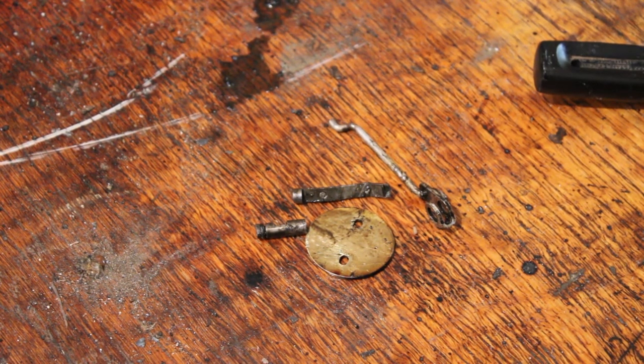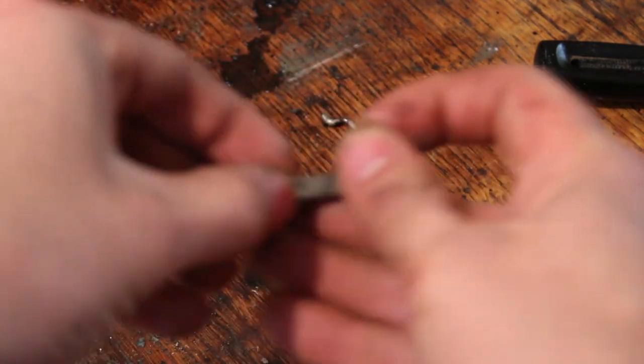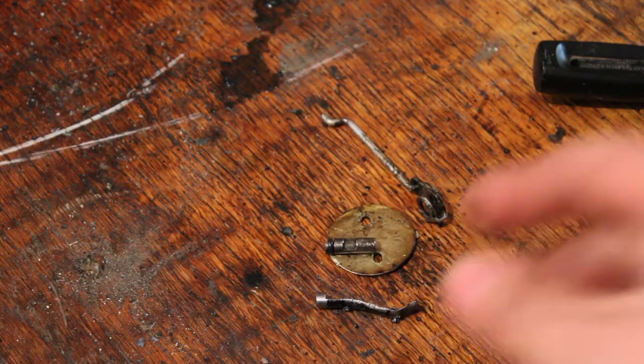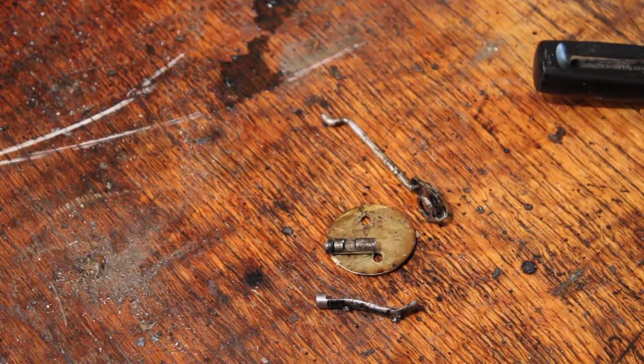I got started with it and it took me the better part of two hours to get it out of there. I ended up just having to break the shaft on the outside — this piece here goes on the end of it — then breaking that off on the outside of the case and bending the inside piece. It kind of just thankfully snaked its way into the bore and I was able to pull it out with a needle nose and a hook. Then the brass plate came out after it. There was just no good way to get a screwdriver in there, and those screws were peened on the backside so they don't come out.